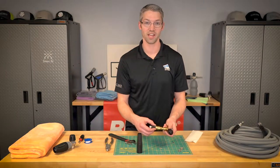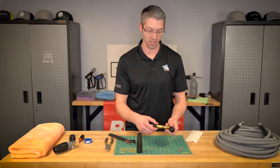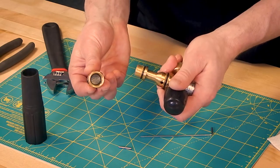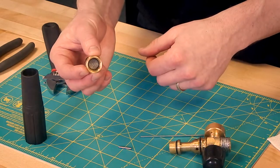These are not tightened down in the standard way similar to NPT where it requires interference. BSP is a straight thread, so all you have is the O-ring, your straight threads, and it hits a shoulder inside. When it hits, it's sealed. You should go just a tiny bit past hand tight. Inside you can see the filter.